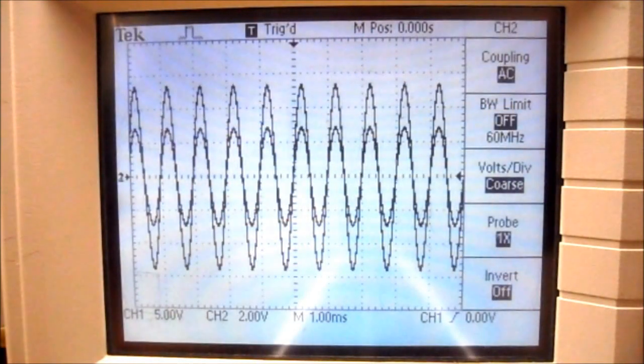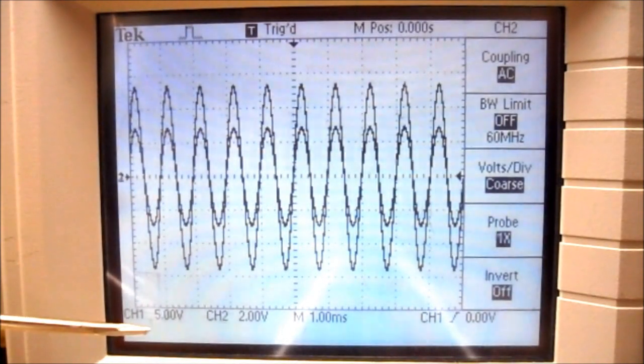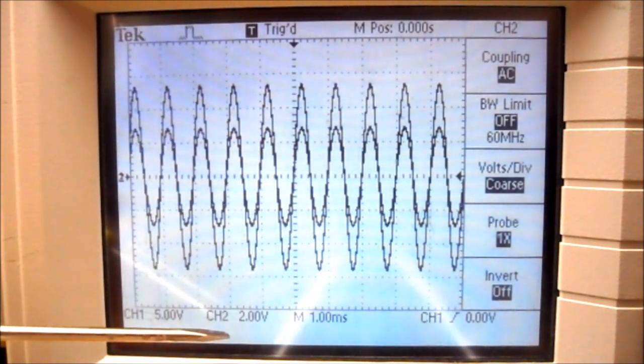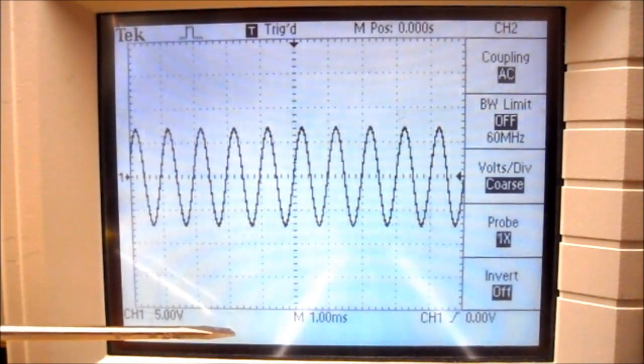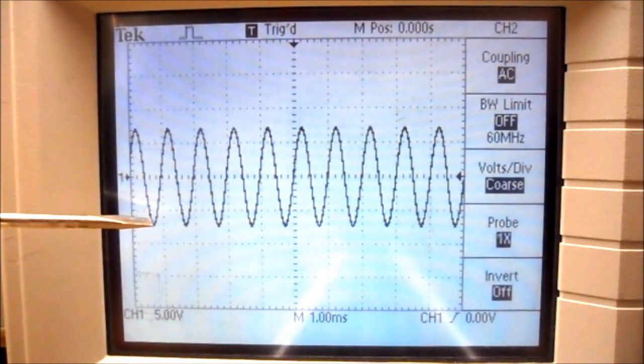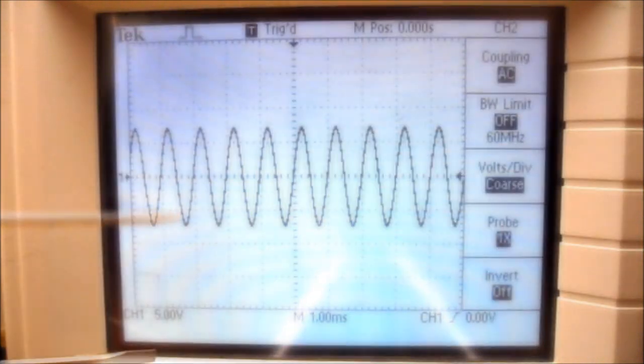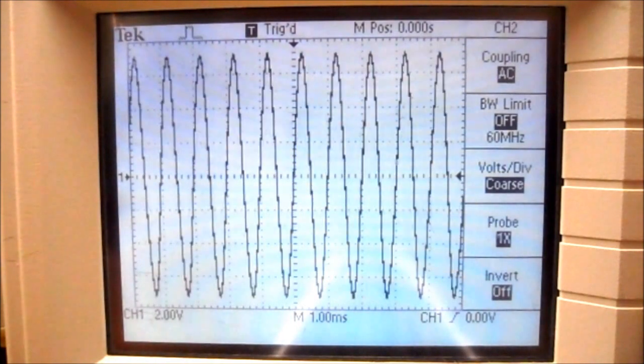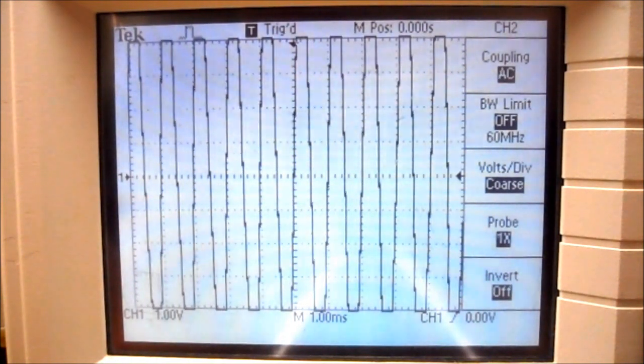So this is what my oscilloscope screen looks like, and you can see channel 1 is on 5 volts per division. So I'm going to press channel 2 to take away the channel 2 display. So now all I'm looking at is the channel 1 display. This is my input voltage. So my channel 1 is still on 5 volts per division from the last exercise, so I'm going to turn it clockwise until I get to 1 volt per division. You'll notice my waveform goes off the screen.